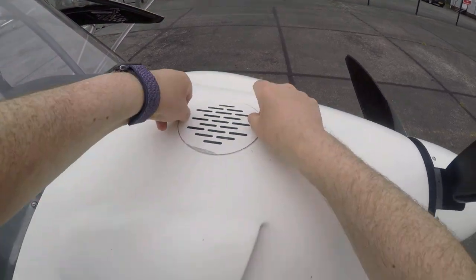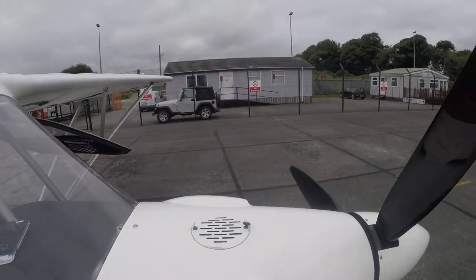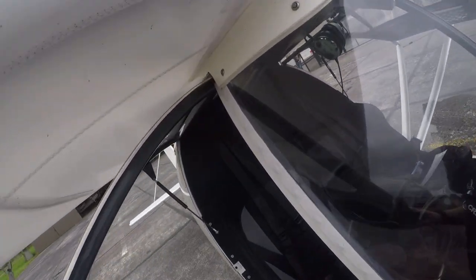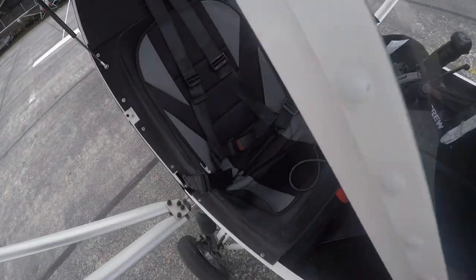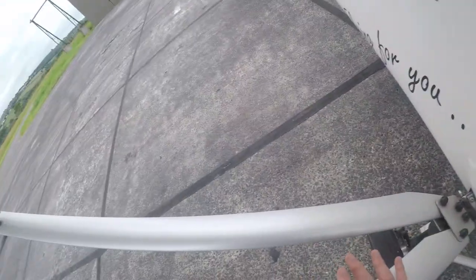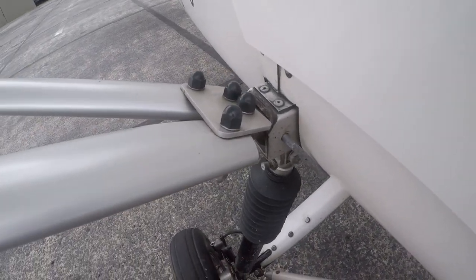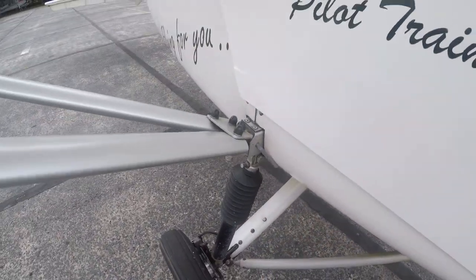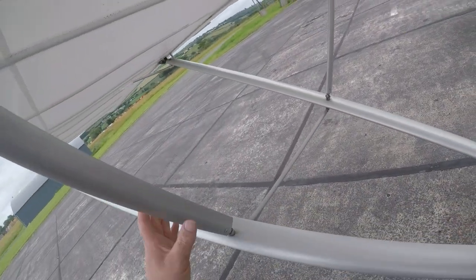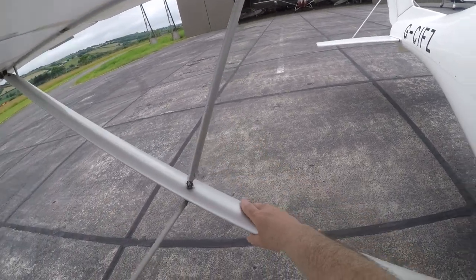There's sufficient water. Make sure that the cowl is secure on this side. On the starboard side, make sure that the door hinges are clear and it locks. Make sure that the pin is actually inside the gear. Check the wing struts, making sure that the brakes are okay, that there's no creep, that it's inflated okay and that the structure is sound. When checking the struts, make sure everything is nice and secure.